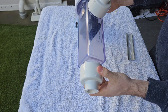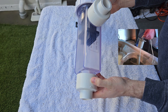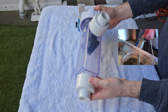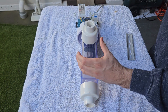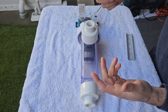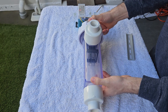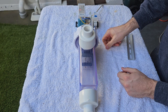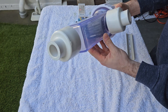The real downside of this is it's gonna be a lot harder to clean. The other ones — both the Hot Spring and the Saltwater Scepter — just sit in the filter, so it's really easy to just pull the unit out, put it in a plastic container, fill it with white vinegar, let it soak for half an hour to an hour, and then the plates are clean. This one is gonna have to go inside the spa pool near the pump housing, so it's gonna be a bit more of a palaver to clean. But then the plates are also way, way bigger, so I'm thinking it won't need to be cleaned as often.